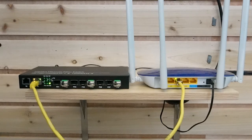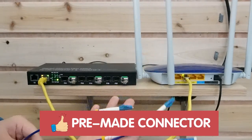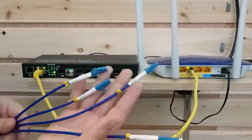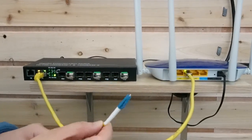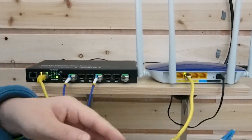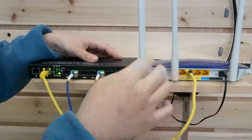This is the fiber optic cable we're about to use. It has four strands from A to D, and it's already pre-terminated, so we don't need to worry about the connector. It's 100% tested at the factory and can provide high speed, low latency, and long distance runs. Let's use strand A first, then strand B, and finally strand C. We'll keep strand D as a spare.